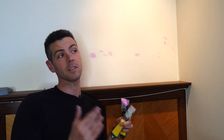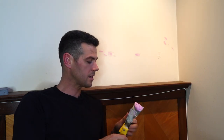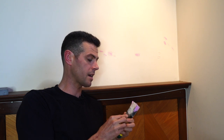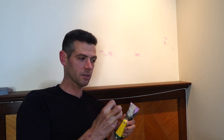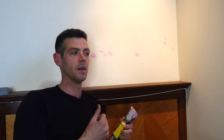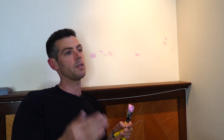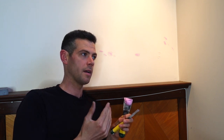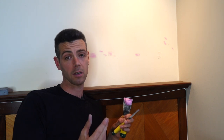We also need to cover some different types of spackle. The other one I use sometimes is Dynapatch. That stuff has the same properties — it's pretty dry. One thing about spackle is it likes to dry out on your knife a lot faster than drywall mud. Both Dynapatch and this dry-dex stuff are pretty dry — they get a little crumbly as the ball keeps getting smaller and moisture gets pulled off from the wall. It takes a lot more effort to keep it cleaner than drywall mud. The use I have for Dynapatch is for filling trim. I don't like the dry-dex for trim because it's not hard enough — it's too close to drywall mud, and I won't fill my trim with drywall mud. So I use something harder and closer to wood filler.